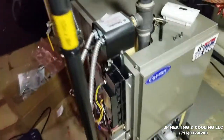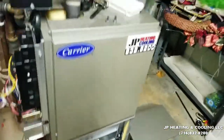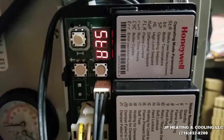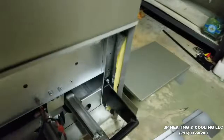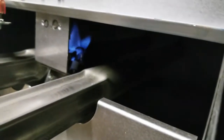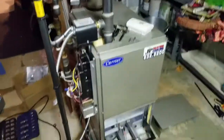We just wrapped up — got the new box installed, the new pilot assembly, and the new ground wire. Turning it on, the vent damper will cycle around and the board is going to go through its sequencing, then initiate the spark. We now have ignition. I'll put all the covers back on and this thing will be a whole lot more reliable.